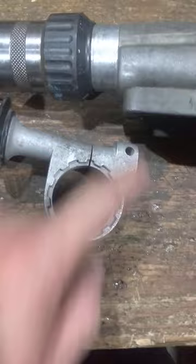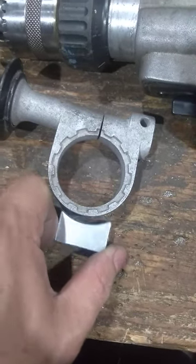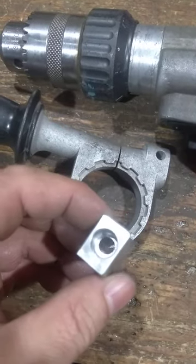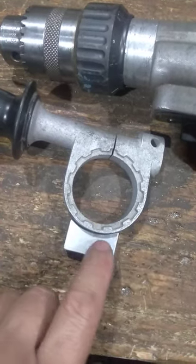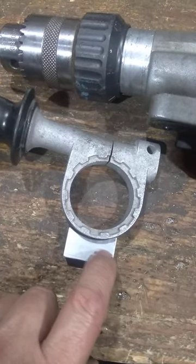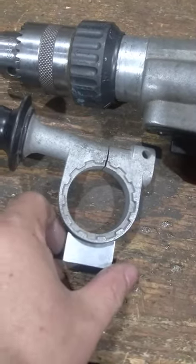The diameter is almost a fit but not quite, that's why I made a bracket like that — just to match this arc over here. I drilled a hole and countersunk it, and after I weld it on here and then cut it off. On this side I'm going to make a quarter-inch thread, probably a helicoil for durability.